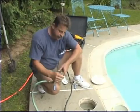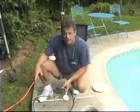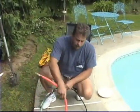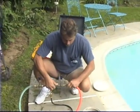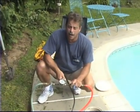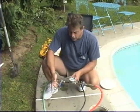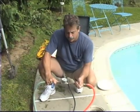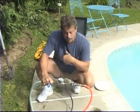If there's no leak, this gauge is going to lock up and we're going to be able to hold 12 psi for five minutes or better. At this point, we break out our electronics and we would induct air to the other side of the system. This gives us a sound signature that we can detect underground. The ditch is full of water, so we leave the water off. Now I can introduce air and it's going to give some gurgling noises, which we can detect underground with our electronics.